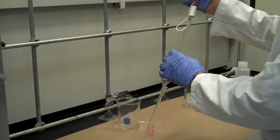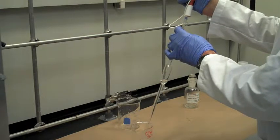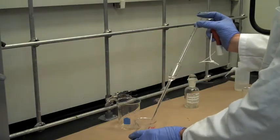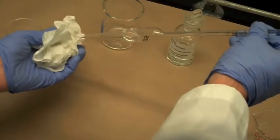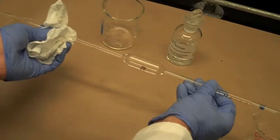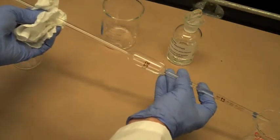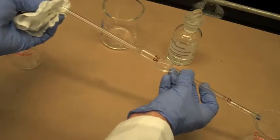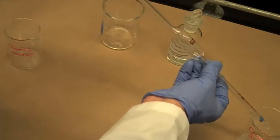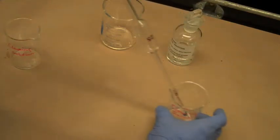Use a rubber bulb to suction some cleaning solution into your pipette. Don't try to fill the pipette. While maintaining the tip inside the beaker with cleaning solution, seal off the open end with one hand. With a paper towel on the other hand to catch any drips of solution, lower the upper hand toward the second small beaker. Be sure it is in place to catch any liquid coming out the upper end of the pipette. Rotate the pipette gradually as you pour the liquid out. This will ensure that the cleaning solution covers the entire inside surface.